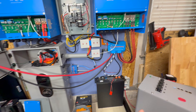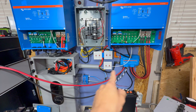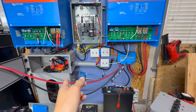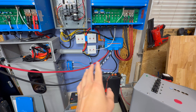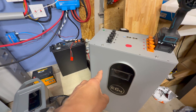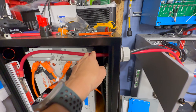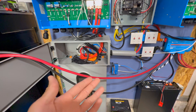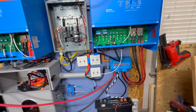The reason we have this second wall mount battery is so we can place it right here. With two wall mount batteries you don't technically need all this Frankenstein setup — it'll look much cleaner. This approach works if you need it, but for a clean install it's better to just put the two batteries there, wire them in parallel, and keep the AO Lithium stack for additional capacity. Each battery does 100 amps continuous out, so two batteries is 200 amps, four would be 400 amps continuous — someone will argue 2-AWG cables may not handle that, but we won't be pulling maximum amperage from all of them simultaneously since they're in parallel.